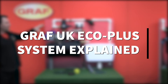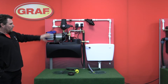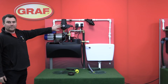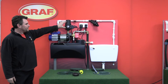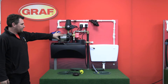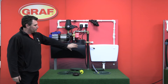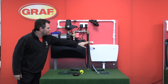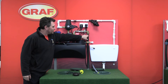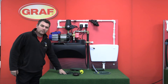This morning we're going to show you our Eco Plus unit. What we've got is a mains water reservoir with the pump and pump controller sat on top — this is our Control-Matic. This decides when we send power to our pump. The pump takes the water from one of two places: it either draws water out of this mains water reservoir, or by changing the position of this red three-way valve, we suck the water through our black and green pipe out to our underground tank and draw the rainwater from there.